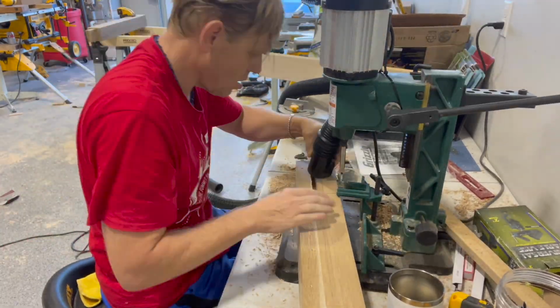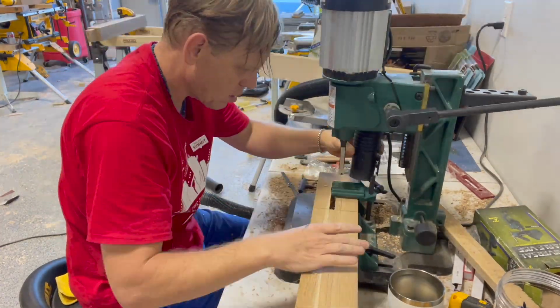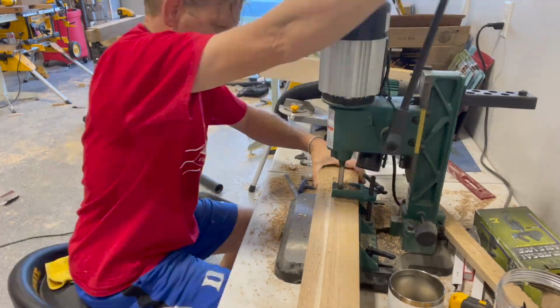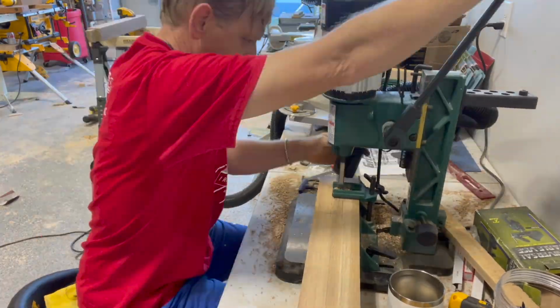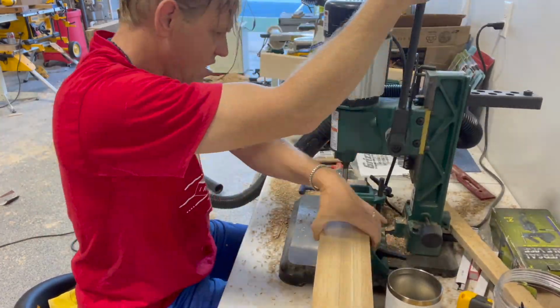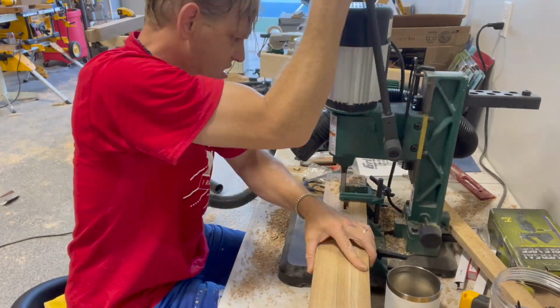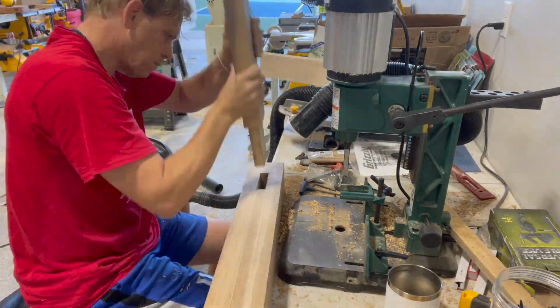through mortise for the upper gable ties. It's a 1/2-inch blade, takes two or three passes from each side. Stay inside the lines, trim up with chisels at the end, and just be patient. Like I said, I average about 1.5 hours per mortise. So there's no way to rush it.